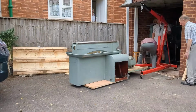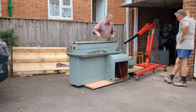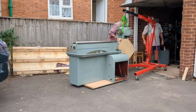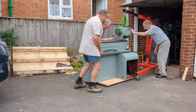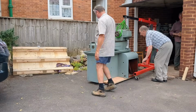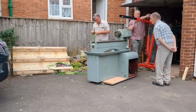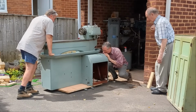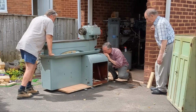into the stand below. Again, we were very careful to ensure that mating faces were clean as we installed the headstock. Using the engine hoist was much easier than doing this by hand, as the headstock has to be dropped vertically into place to locate the single dowel pin. I keep an old piece of sturdy worktop counter for shifting things around.